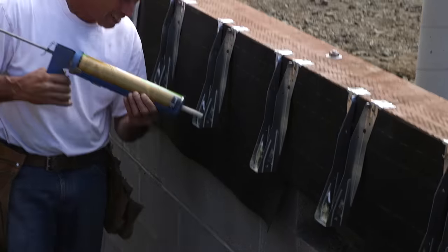So you don't have some that are 11 3/4 and some that are 11 1/2. You have one perfectly flat floor system if you're careful in the installation. You have a uniform fastener gripping capacity in that top flange. You're not running a screw or a nail into a pitch seam or into a knot or onto an edge that's got wane. You have a uniform width, a uniform density, and so your fasteners are all going to hold